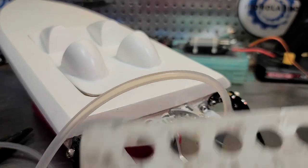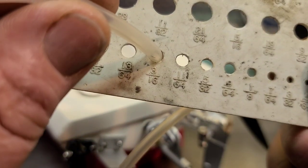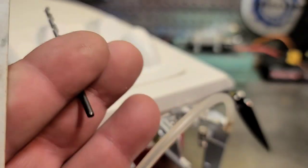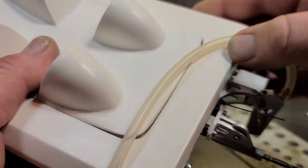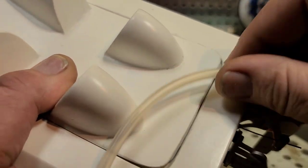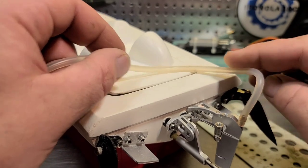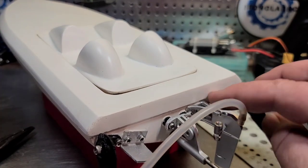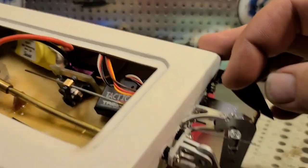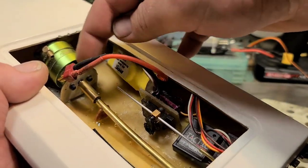I've got my cooling line — just using what came with the kit. I've got my little measuring drill bit, 3/16 cooling line. I'm going to drill a pilot hole and I've already got the correct drill bit ready to go. Whenever you're running your cooling line, make sure you don't run it anywhere you're going to be laying tape, especially if you're relying on tape to hold your hatch down. I've done that in the past and regretted it. Final answer — I'm going to run it right through the transom.